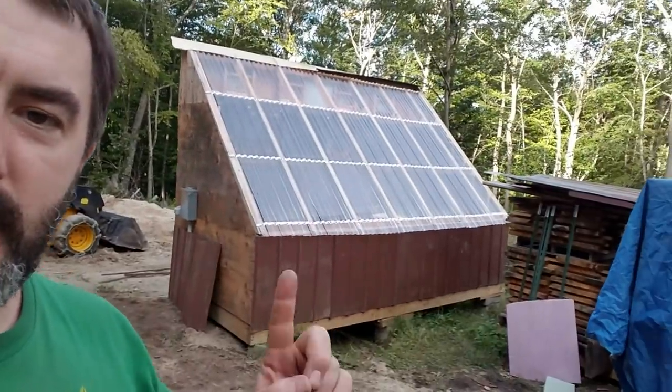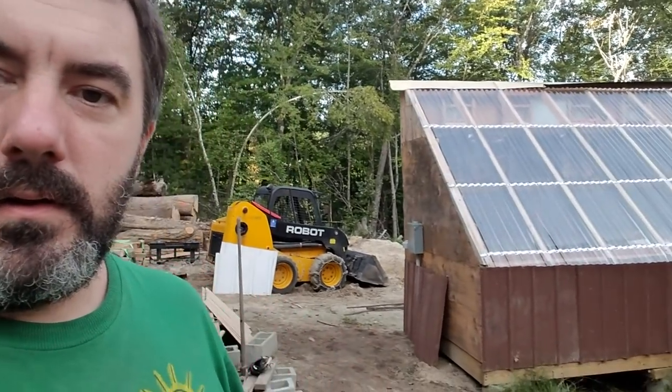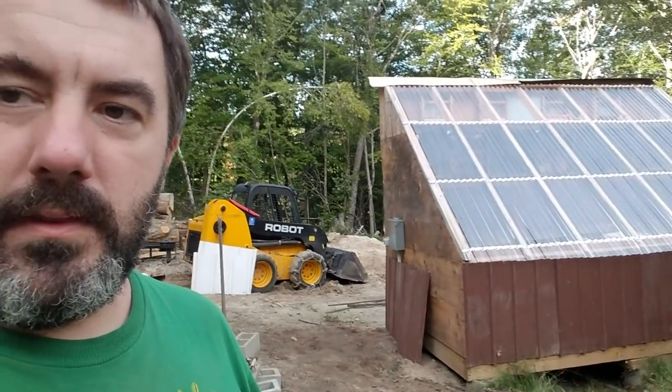A few things I've done today — the big thing is the solar kiln. I got some metal siding put on the front of the solar kiln. And even more importantly, see that box right there? That's a sub-panel. There's 60 amps of power now going to the solar kiln for the fans. We have three fans in the solar kiln. I've added 16 60-watt bulbs and a 70-pint dehumidifier to the kiln, and it's actually been amazing.